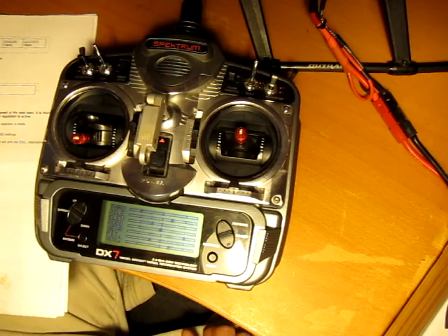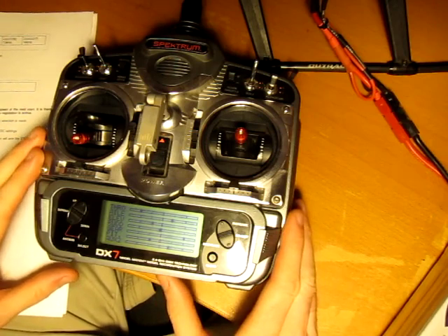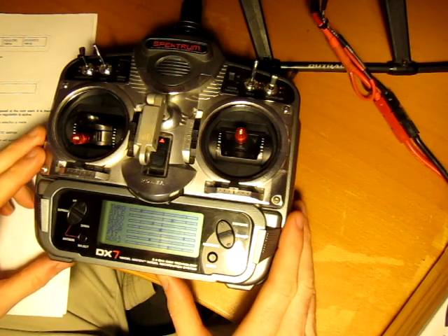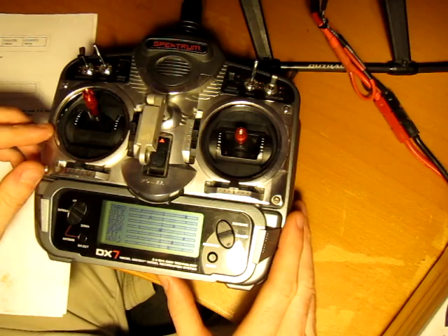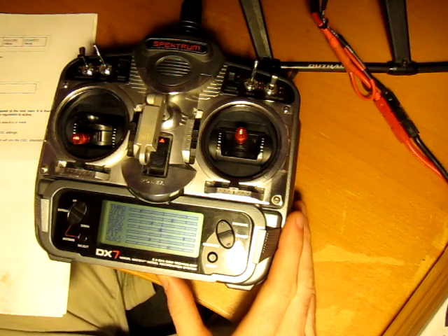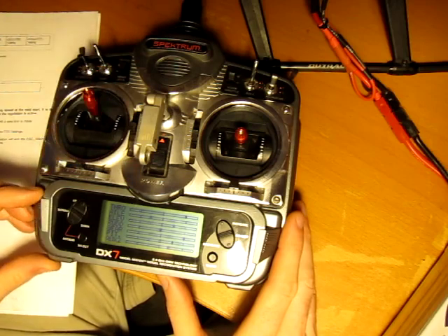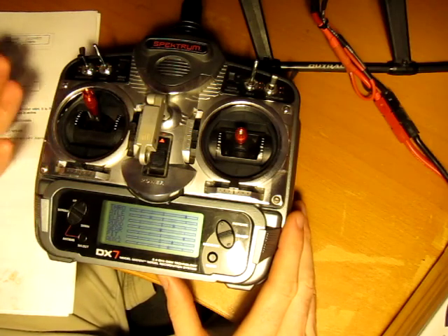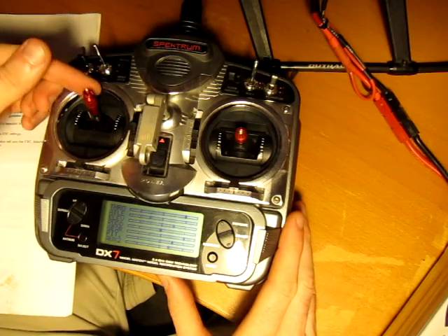I'll show you when we get to five chimes what happens. Now I go up... back down. It chimed twice telling me that I actually had governor mode on already. But I'll set it again just so you can see — two chimes, that's on. So basically now you get kicked out of the menu, it does the lipo count-off, and if I went back to low it'll arm.